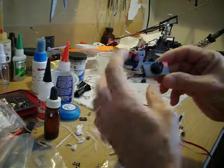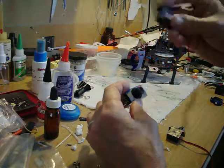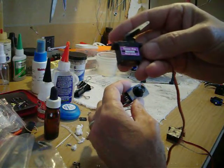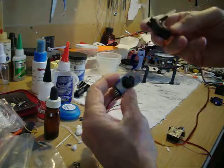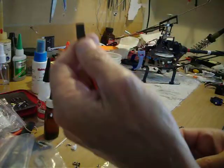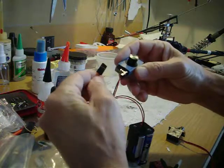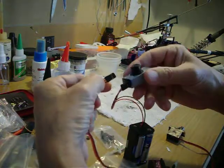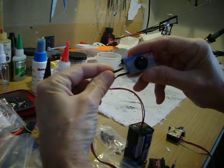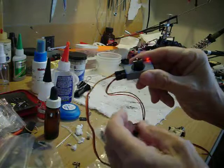You've got three selections — I've got it in neutral right now. If I take a servo, and this one is a TowerPro MG90S, which I believe I got from banggood.com, it may have been altitudehobbies.com but I can't remember. You just plug it in with the negative, the dark wire, in the same orientation as the power source. You've got three servos that you can connect, so I'll just connect it to any one of those.